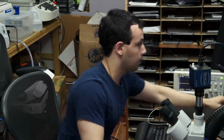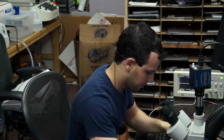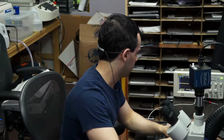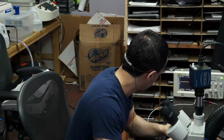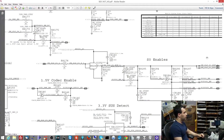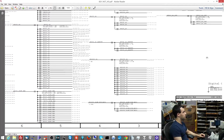you'll be able to see that where I want to have a 5-volt rail, I have a no-volt rail. See? I got nothing. Take it away, put it there, take it away, put it there. You may wonder how I know to measure there. Well, as I said, the schematic will actually give you a list of power rails in the machine.